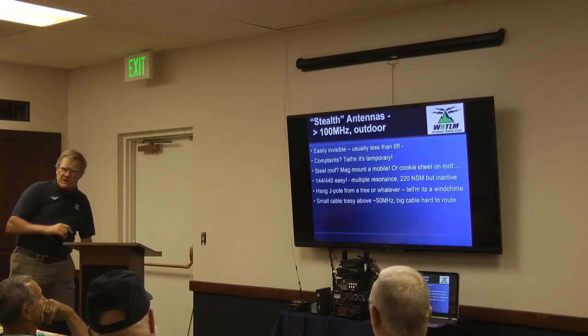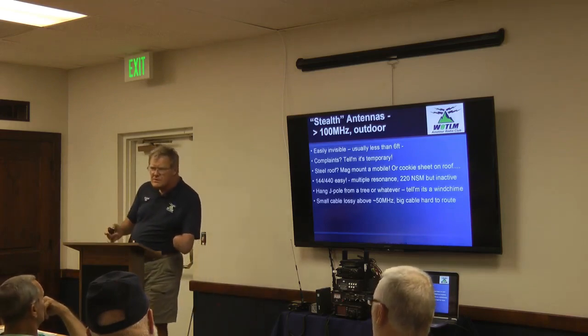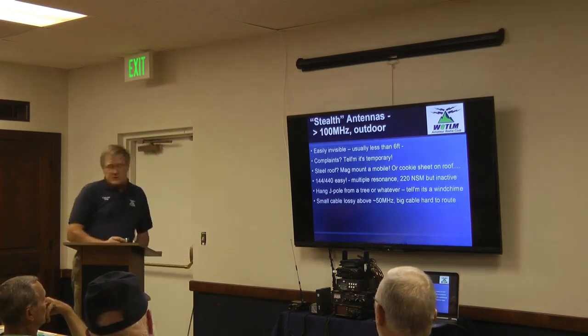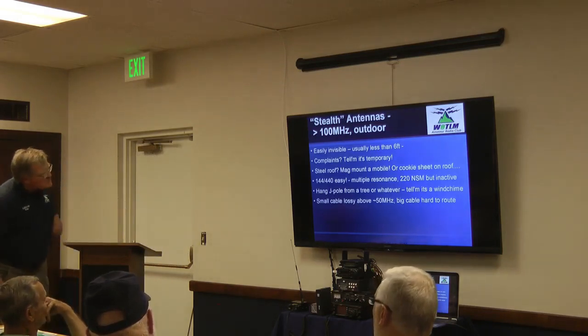144 and 440 megahertz is easy because they're odd multiples of each other. So if you've got an antenna that tunes to 144, it's generally going to work pretty well at 440. 220 not so much. That's what NSM means to me, not so much. I may have to spell that out so people know what it means. But 220 is not very active anyway, so who cares?